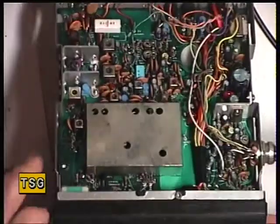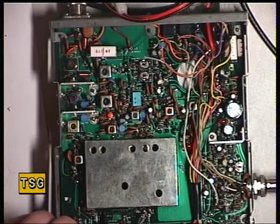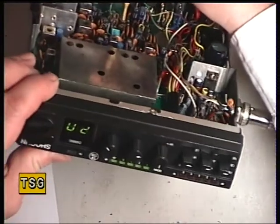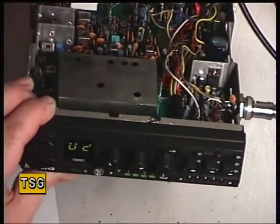We'll see what we've got on the signal meter — we've got plus 30. So we'll reset that for S9. That's variable resistor 5, which is down there at the bottom. There we go. And that is plus 30, so that's lovely.